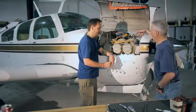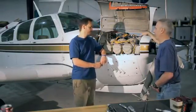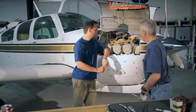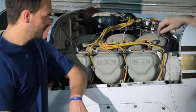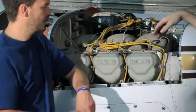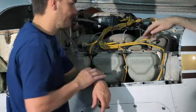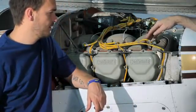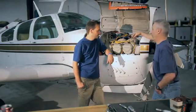When we're doing an annual inspection, we open the cowling up and the first thing we do is get a general look at things — make sure everything looks like it's in good working order. We look at the leads; sometimes you'll see where they've been rubbing on parts of the engine or cowling. If it rubs long enough, the spark can leak out — if the shielding gets stripped away, it'll actually jump out, because if you give that spark a place to go, it's going to come out of there.